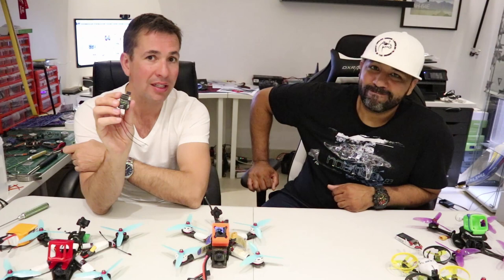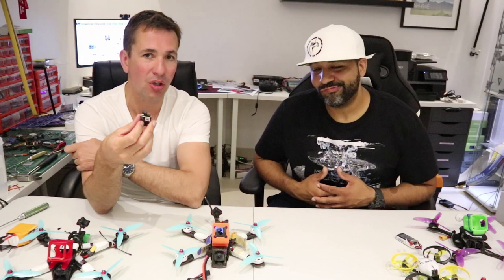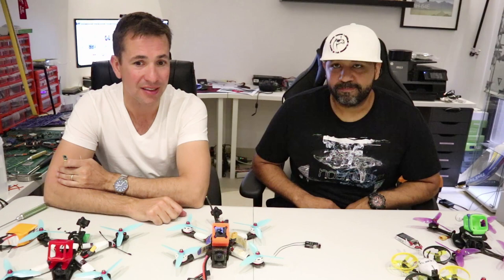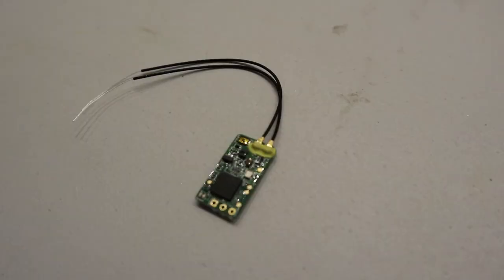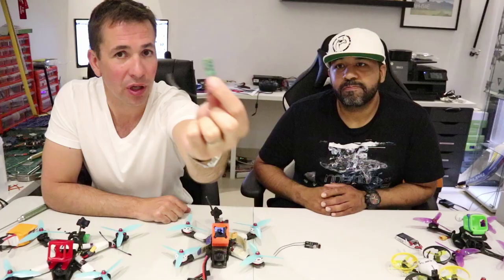So for those guys that used to fly old school planes, where you had four different servos, so four different channels, that's this guy, which is no good for mini quads, because whilst you can use those four channels on mini quads, we use S-Bus because it's faster. So I guess it's like using old school talking versus high speed wire, digital, and so that's where this little guy is. So you can probably tiny see there. So he's tiny, he's S-Bus, which is fantastic. So we can put that into his Rooster, and we're going to do that a little later.